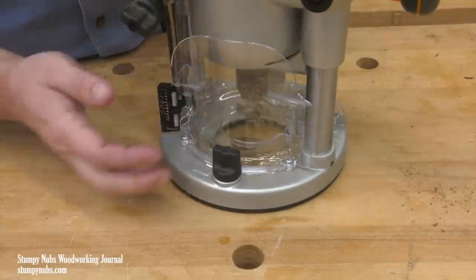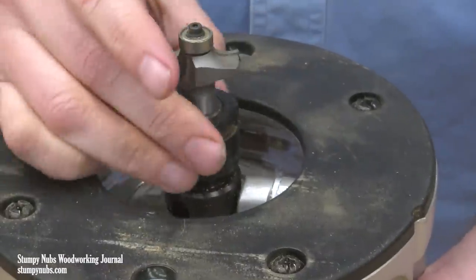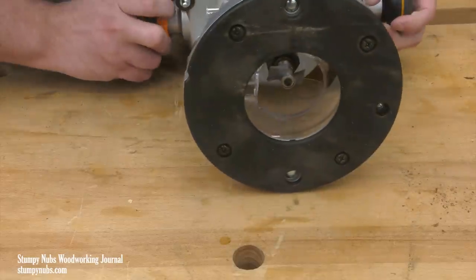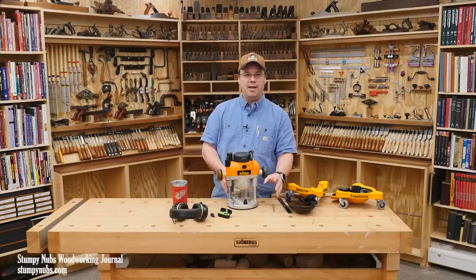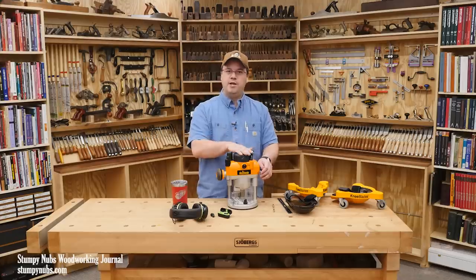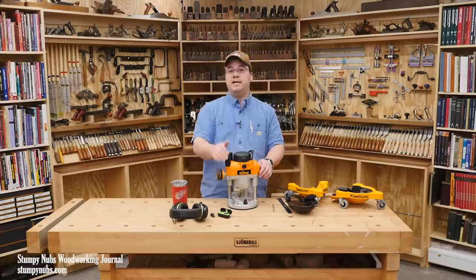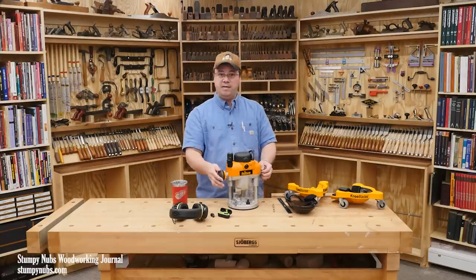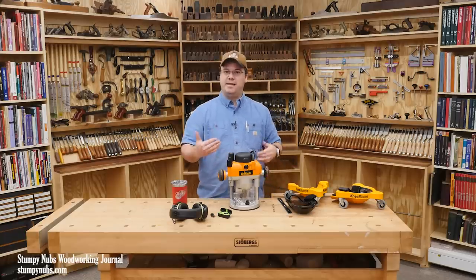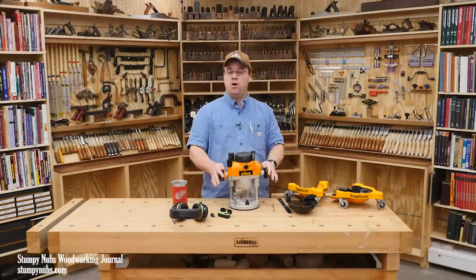There are sturdy polycarbonate shields on both sides to keep your fingers away from the bit, but it doesn't get in your way because bit changes are done above the plate. There's also a built-in port for a vacuum hose to suck up the dust — dust collection has always been a big issue with routers, and dust ports that attach are usually in the way and easily broken, so this design is a big improvement. It's a three-and-a-quarter horsepower motor so it can handle big routing tasks. They do make a smaller version, but the bigger one is my favorite. It has soft start, variable speed from 8,000 to 21,000 RPM, and a dynamic load monitoring system to maintain consistent speed whether working hard or taking a light pass.